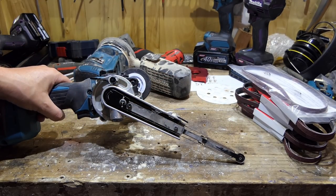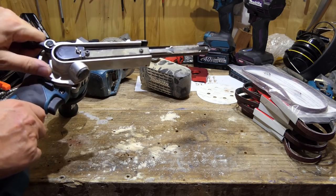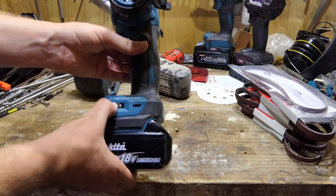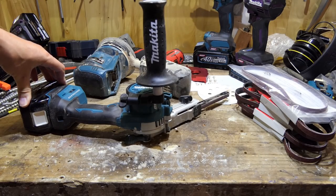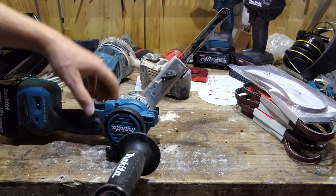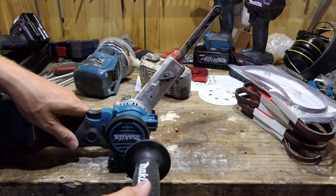I love the power of it — it's good, not too much. At times I sort of wanted maybe a little bit more, but you know, it's a sander and I was pushing it doing things you wouldn't normally do. The angles and adjustments are pretty good — I tend to use it on about a 45 degree angle with the handle, which feels natural. I also tended to use it mostly on speed setting three in practice, though in the video it's often on five because you try to do things quickly. Of course you've got the locking feature and you could mount it if you wished.